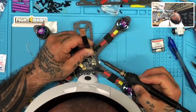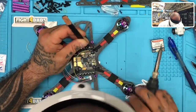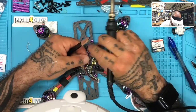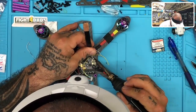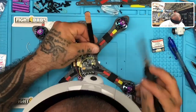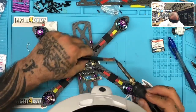Again, we're going to get to the SDA here and SCL, so bear with me a second. Actually, I want to go with my SCL first because I don't want to have to jump over. So we'll do the SCL first. That's going to be our gray wire. So let me go ahead and just get it down right here. There we go. And then we can do our SDA right here. This way we're not getting close to crossing them. Okay, so those two will be fine.